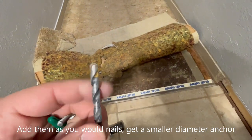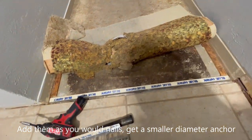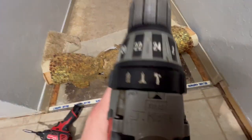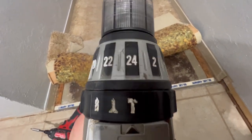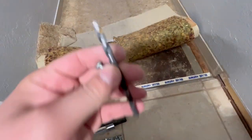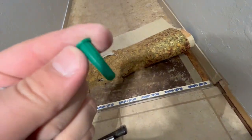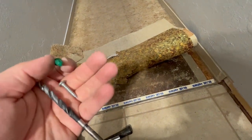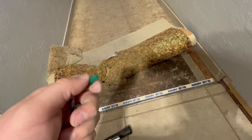In order to do the anchor and screw setup, you need a masonry bit or cement bit and a hammer drill — it has that little T on it. If you don't have one of those it's not going to work as effectively. Basically what you do is pair this bit up to the correct size of your anchor. Depending on the size you want to go — I recommend going smaller if you can.